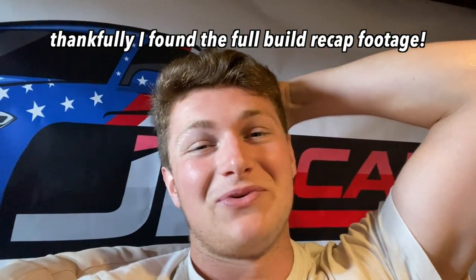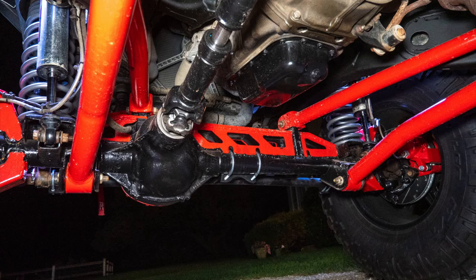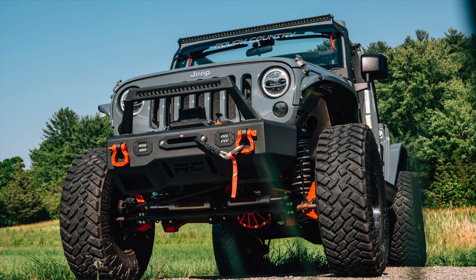I'm back at school now finishing up editing this truss and gusset video. Unfortunately I just realized I lost both the outro for this and the full build recap, which is pretty sad. But I am glad to say the truss and gusset worked out really well. Aside from one minor issue with the steering stabilizer - I had the dual steering stabilizer setup from Rough Country, and because of the truss and gusset I wasn't able to angle the center bracket backwards, which complicated things. I had to modify that bracket to get it to work properly, but it all worked out in the end. It did feel like it stiffened up the front axle and the front end. All in all, great project - it was fun, pretty inexpensive, and looks great as well. Hope you guys enjoyed this video. Thank you so much for watching and we'll see you next time on JD Cars.